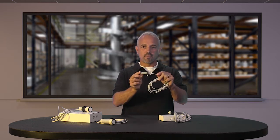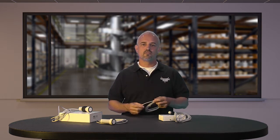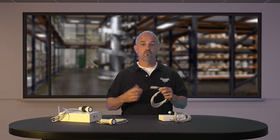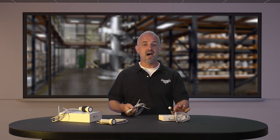These ultrasonic sensors have a limited lifetime warranty. The UK 6 series 18mm sensors are the least expensive ultrasonic sensors that Automation Direct carries and have a shorter barrel length for tighter mounting applications. They offer analog outputs of 0-10V DC or 4-20mA, and you can purchase styles with switching outputs in NPN or PNP in normally open or normally closed configurations.